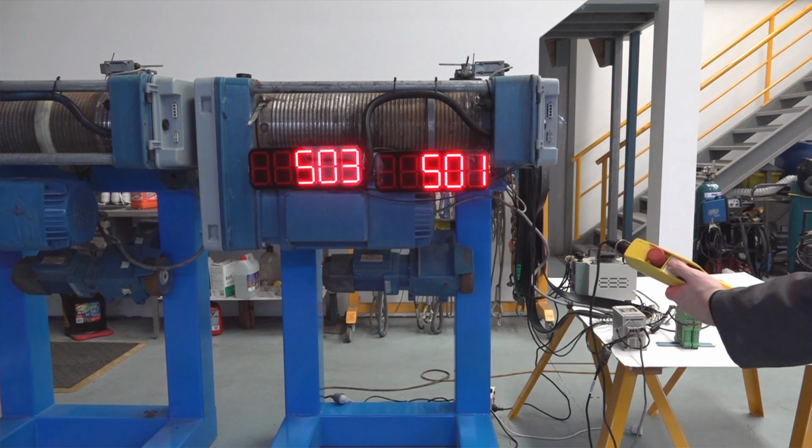To really demonstrate just how durable and robust this system is, let's test it under the worst case scenario. Here we have Doug, who's going to TIG weld on this unearthed piece of metal, running kilovolts of interference through the sensors. Even with these thousands of volts though, we can see the same results. The analog system is jumping around all over the place and misreading as these huge voltage spikes affect it. Whereas the digital signals don't change at all. It's rock solid. And this is because the D-Cell is continuing to move this data back digitally into the load display, and that digital signal is unaffected by even this much interference.